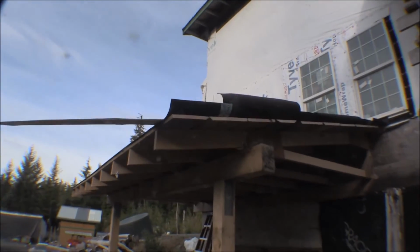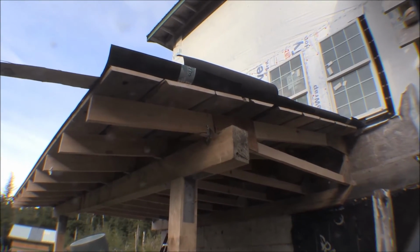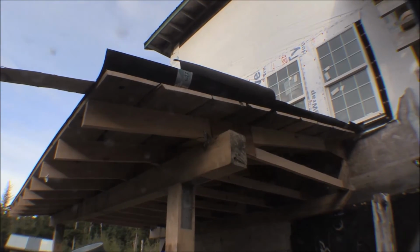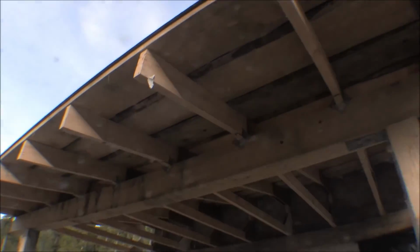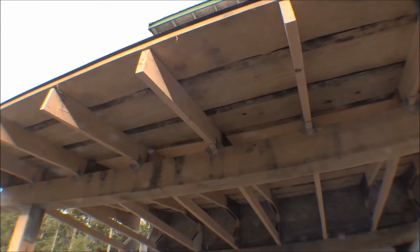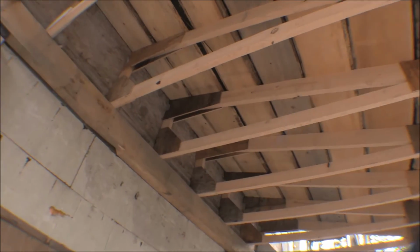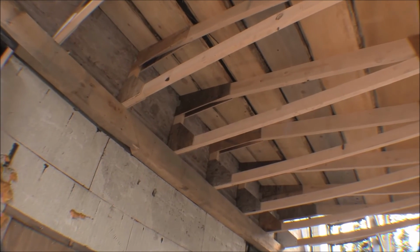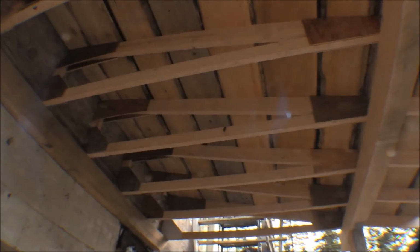It's all covered up. Stiffened that up pretty good having the boards up there. These are flitches. These are the offcuts from the logs when I mill them before I get down to cants to make boards out of. And so most of them have wane on both sides of them, and they're various widths ranging anywhere from 8-10 inches wide to 14-15 inches wide, but they work just fine. We thought about getting a radial arm saw out and trimming them up and truing them up, but these are pretty good. Well, the last board we had to cut a little bit to fit it in there, but there's 1, 2, 3, 4, 5, 6, 7, 8, 9, 10 boards covering 11.5 feet.